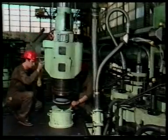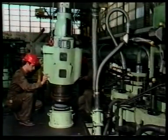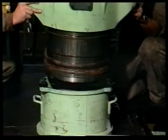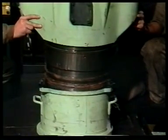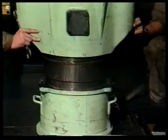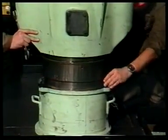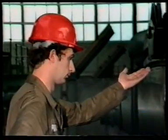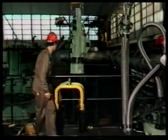The valve must be protected against damage. For that reason, the valve protector has to be fitted whenever the valve cage is dismounted from the engine. The valve cage is transported to the place where overhaul of the valve will be undertaken. That place should be as free from vibrations as possible. A spare valve must always be on board.